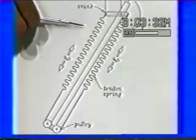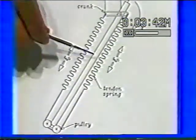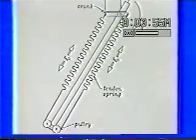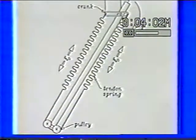Here is what LIVE means. Two elastic tendons are stretched down either side of the leg and connected around a pulley at the bottom. At the top they're connected to a crank. The idea is to keep the tension on either side the same and essentially independent of angle. If the crank is symmetric around the joint, this arrangement produces no net torque. But if the crank is displaced, you get a torque proportional to the asymmetry. The key point is that the torque is independent of angle, so you have all the freedom needed for passive walking.